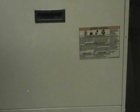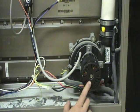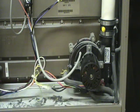We're going to look at a high efficiency gas furnace. This is an upflow furnace. Remove the upper access panel and right here is your inducer assembly. This is a high efficiency furnace, so you'll notice that the housing of the inducer assembly is plastic, and it's connected to a plastic PVC pipe for the outlet.